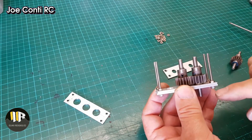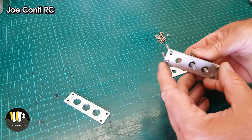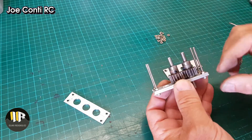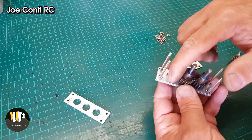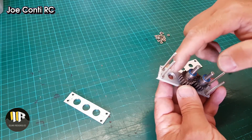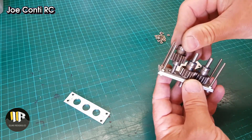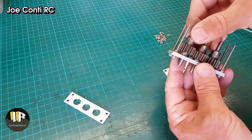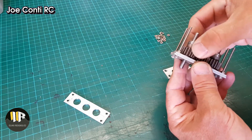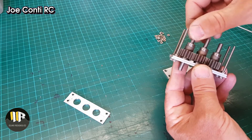I've tied the two plates on one side together with a nut. You can see the recess there — the wider and the narrower hole — and this is how I keep the bearing. The shaft goes in loose but the bearing goes in tight and stays in place. And this is how I keep them together.